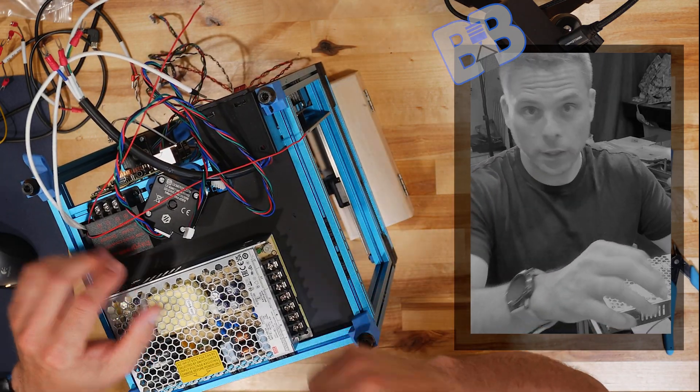The kit provides a cord right here that will eventually power the Raspberry Pi off the 5-volt side. Right now we need this wire here — it's already pre-labeled: '5-volt power supply' and '24-volt in.' Make sure you don't get them backwards. You also need to make sure you use the right terminal screws, because you do have two sets.